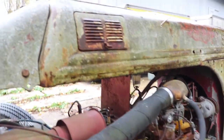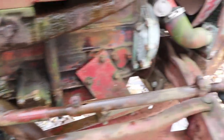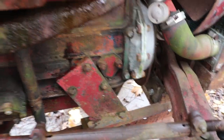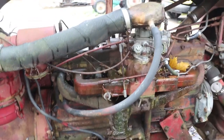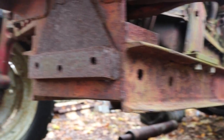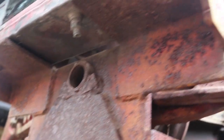One thing I do like about this tractor is with the hood up higher, there's a lot of space in here. The gas tank is part of that, but if the gas tank was removed and this engine wasn't here — if we just look down where an electric motor would go — with just an electric motor in there, there is space for batteries. This bracket and this weird sub-rail that holds the front end on could even reinforce it some more, maybe by building a battery rack that would tie it all together. And we'd get rid of so much of this — no distributor, no pulleys, no spark plugs, no exhaust, no carburetor, no gas tank. All that would go away. Looking at these welds and the way this is built up, this looks like a do-it-yourself project — somebody cut down some brackets. So I think this is a stretched-out 8N, as far as I can tell.